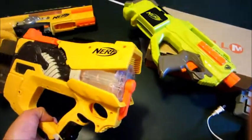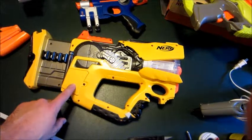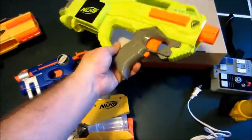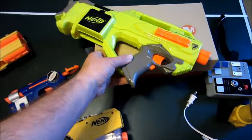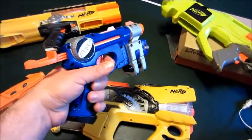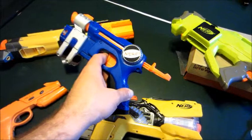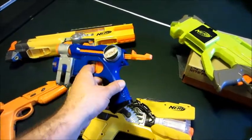When I made my Firefly re-casing, it's already using two AAs to power that strobe light. I just re-wired those AAs to power a Laser Challenge board, because the Laser Challenge board only ran off two AAs. If you're thinking about a Light Strike re-casing, the Raven is an excellent candidate because its battery pack already has four AAs. Light Strike blasters run off four AAs. The Night Finder is probably one of the easiest ones for a simple re-casing — a lot of Laser Challenge blasters just use two AAs, and it's very easy to revert that power supply to work for your laser tag board.